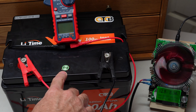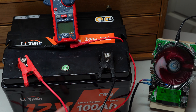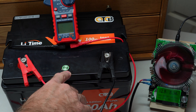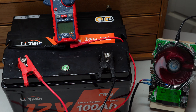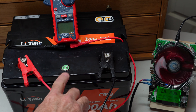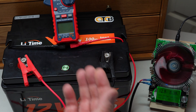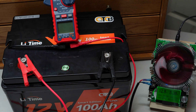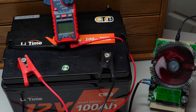There are other functions of the one-touch button worth noting. On low temp cutoff, if you want to override it — as long as the battery hasn't reached negative 4 degrees Fahrenheit — you can override the low temperature cutoff for an emergency situation. They say it's for emergencies only because you don't want to do this during just any freeze-thaw period, as you could shorten the life or possibly damage the battery over time. If it's in a low temp protection state, give it a short press, and within five seconds give it another short press, and it will go green and allow you to start charging if you need to.